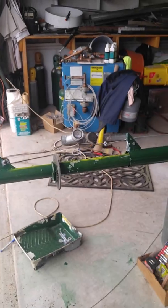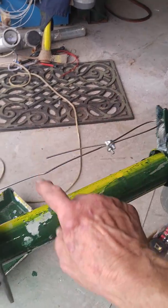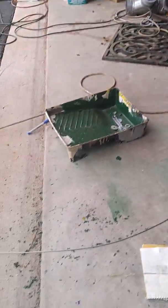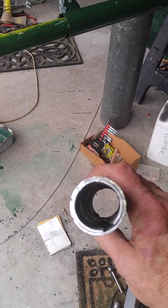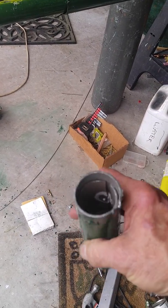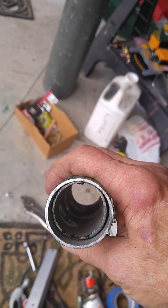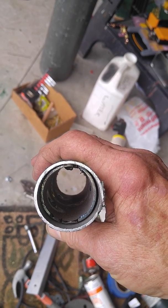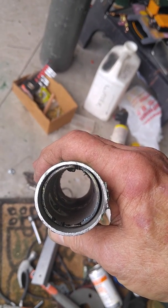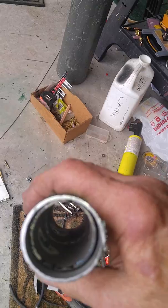It took me a fair amount of time — I had to do some planning. If you're going to repeat this, I would suggest you consider 2½-inch EMT, 2-inch EMT, and 1¼-inch EMT. When I put the sleeves in there, everything looked great. This is one of my sections that didn't work out — you can see how the sleeve goes inside here. What had happened was when I did my plug weld, you see the little white spot? That little spot is part of the plug weld, and you can see it in relief here. It sticks out inside, which made my dimensions wrong. Otherwise I could have used 1½-inch in the top section, but this little bump prevented me from putting 1½-inch material in there — it was just too tight, so I had to go to 1¼-inch material.